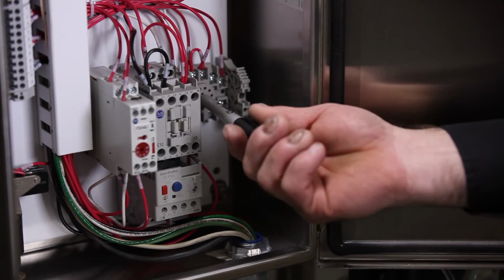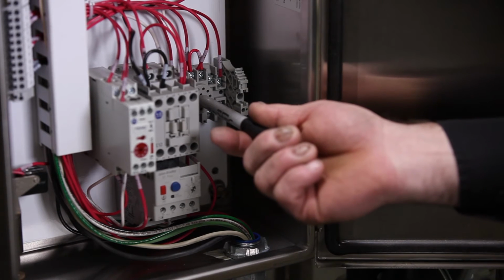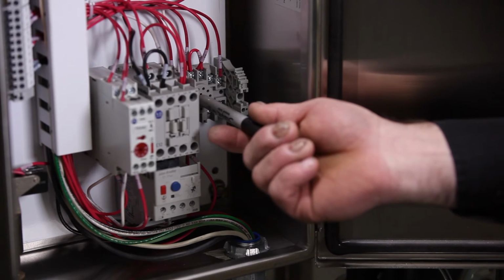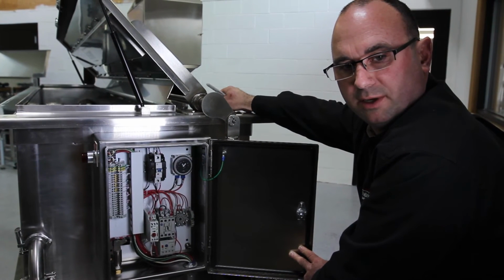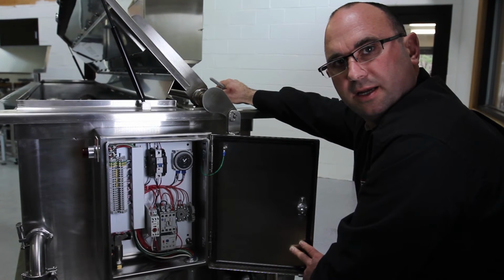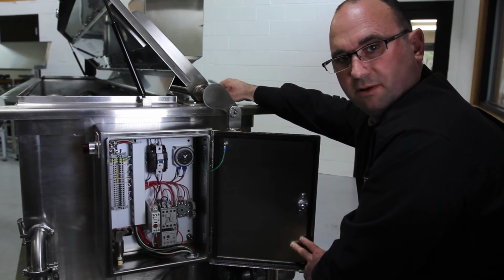This little device over here is a mounting pad for the automatic level control or water makeup. If you purchase this option, we slide a controller in there, and then there is a port we put in the top of the tank and wire in so that you hook your water supply to it, and it automatically refills and maintains the level of the tank.